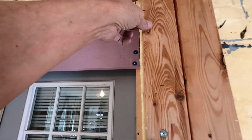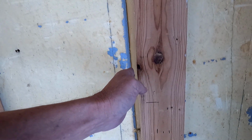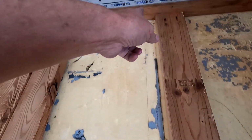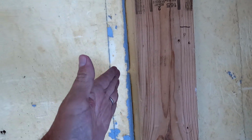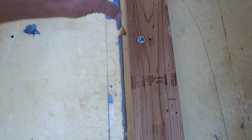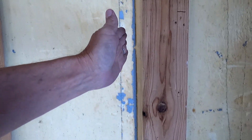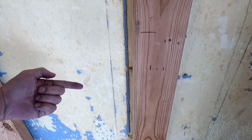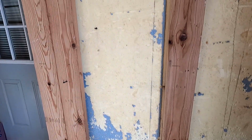The header stud is going to go across, and my final stud is going to come about a half inch away from this. So what I'm going to do is notch it at the bottom, connect it at the top, and that little space, whatever that space is, I'll get it nice and plumb, measure that space, and cut some little fillers. Maybe 4 of them. This might not be perfectly plumb, so I'll get my board perfectly plumb and measure each distance, cut a little spacer, and then screw right through this last stud. And that should make everything really nice and tight.